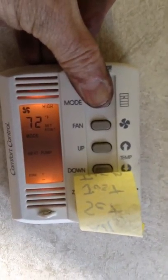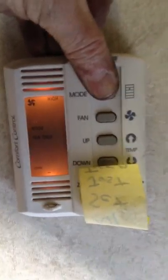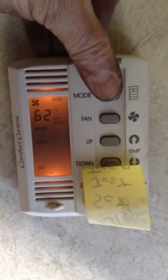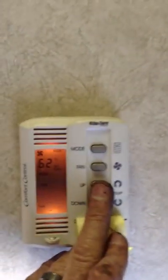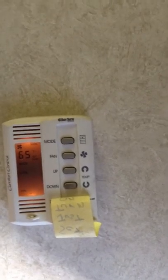Do not run them on heat pump. If you want heat we'll use the propane furnaces. So we're going to use these on cool only. The temperature should be set somewhere around 65. There's no sense turning it down lower — it just makes them ice up. 65 is plenty cool.